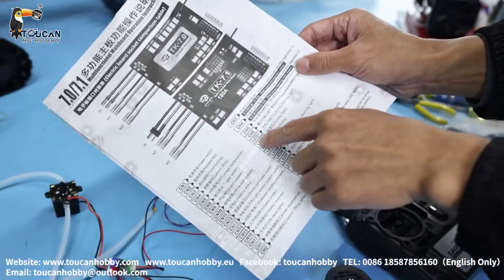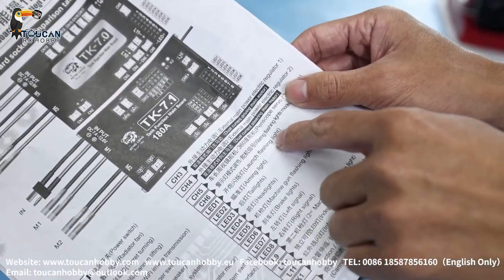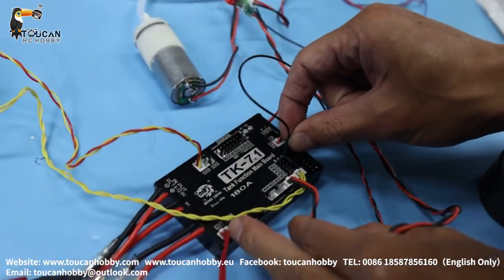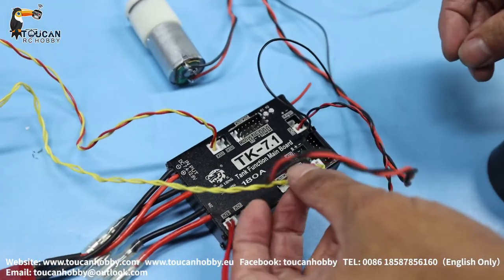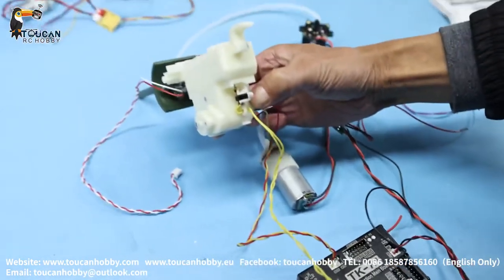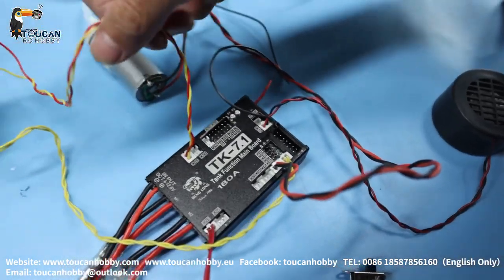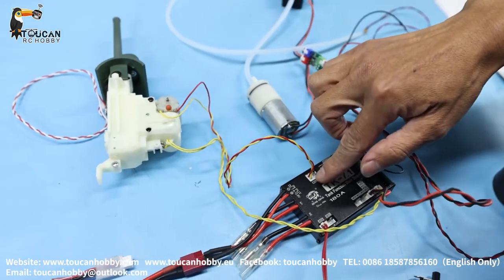So check your manual. LED1 is launching flashing light for firing. So this CN5, LED1, negative side for signal. And this side, this one is the trigger switch from your barrel — trigger switch. And this wire, this is CN6. So another one is this wire from the motor from your barrel, BB shooting, connecting to CN10.